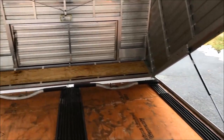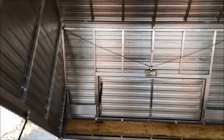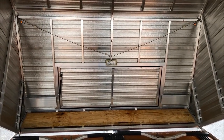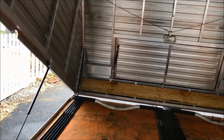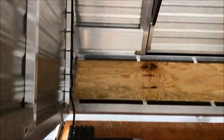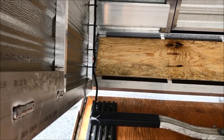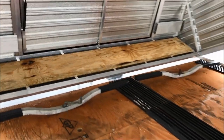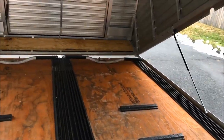It's got the hydraulic lift supports. It also has auxiliary lighting that basically taps into the trailer lighting, so there's a light you can turn on when you're loading at night so you can see what's going on. As far as the wiring, all we did is drill a hole through the deck and tie it into one of the marker lights — that's how we're getting lighting into the trailer. Works pretty well.